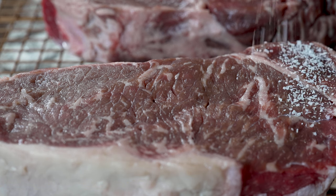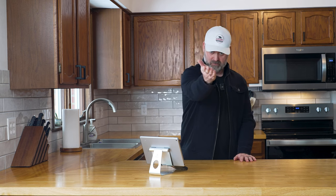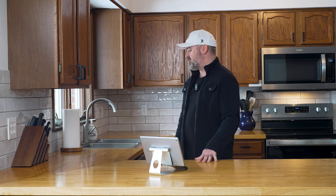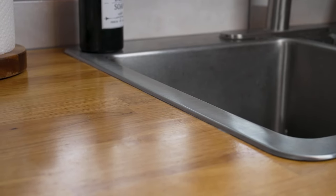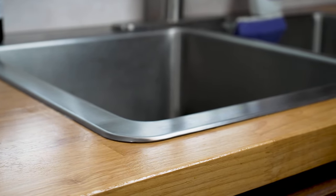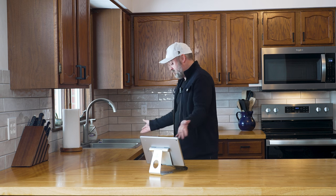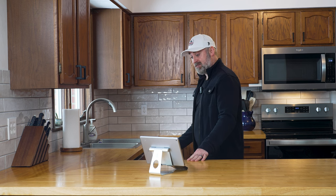You will have areas that get more use — that's just the reality of a countertop. This is where we do the bulk of our prep work for every single meal, and where our kids play. The other area that gets a lot of use will be your sink area. Before deciding on butcher block, I watched a ton of review videos with people complaining about water around the sink degrading the wood. That has not been my experience because of the Waterlox. You can see for yourself: no stains, no warping, no issues after the first year. If something does change after three years, the great thing is you can give it a light sanding, clean it off, restain it, and you're done.